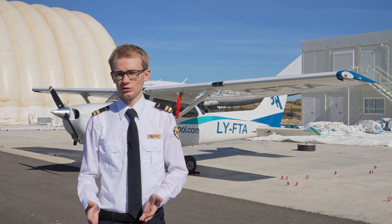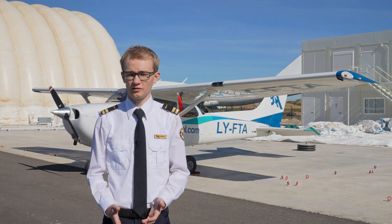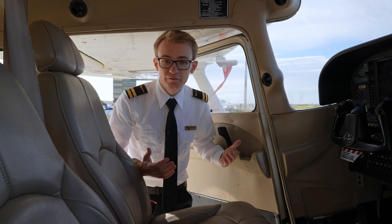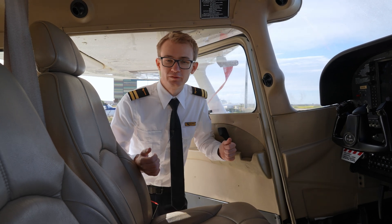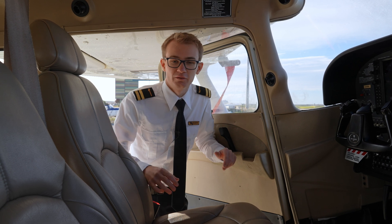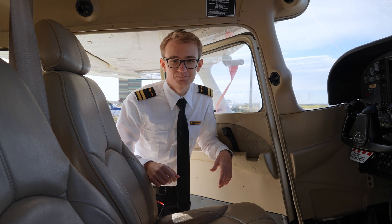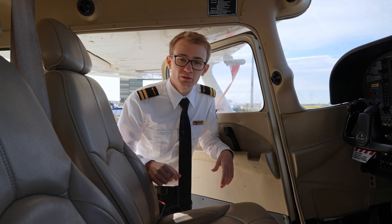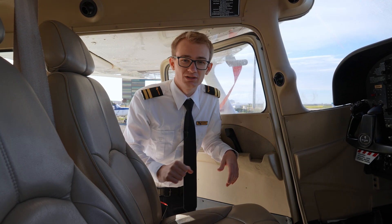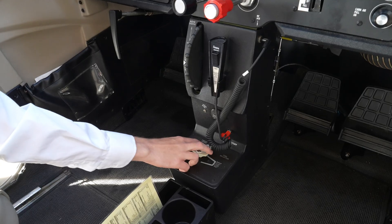The aircraft is currently in a cold and dark state, having last flown yesterday. So we will start off by sumping the fuel tanks. It's a good first step if the aircraft hasn't moved for a while, since any contaminants would have nicely settled into the sumps of the fuel tanks, and we don't want to move the aircraft too much before draining. We will use both the right and left wing tank drain valves as well as the ones in the nose. Before we do anything, we switch our fuel selector valve to both.